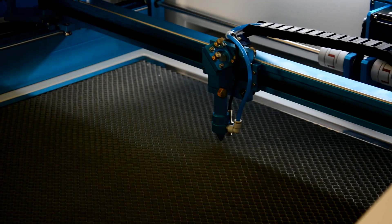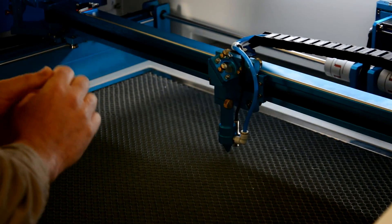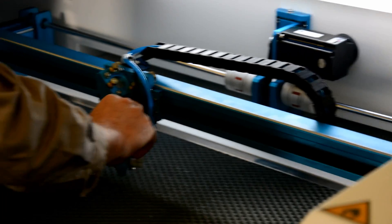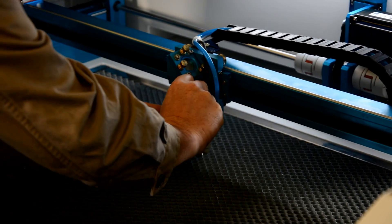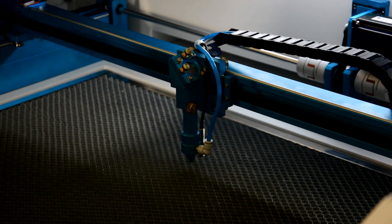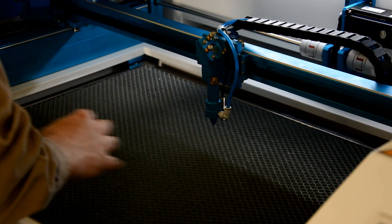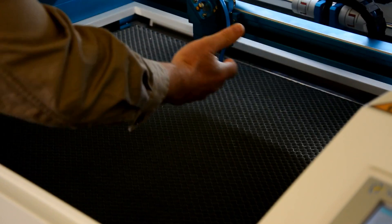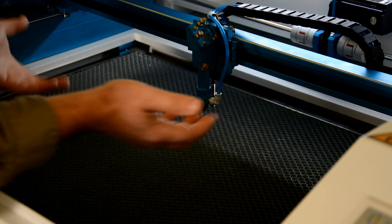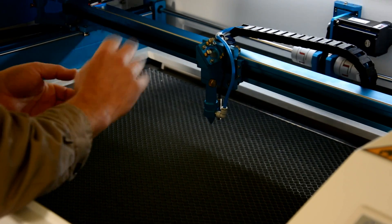A lot of the components here show they've done an incredibly good job of their finishing. They're spending a lot of time and attention to detail in their anodizing, and everything — screws, fits, adjustments — is working really, really well. The Z-axis tables are really sweet; this is a crucial component of the machine. If your Z-axis table is not level with your laser head, there's no way you can cut across your entire table — just like if your beam alignment is out. Again, Thunder Lasers have been hitting the mark on every single piece.